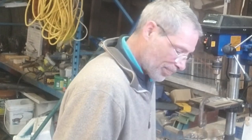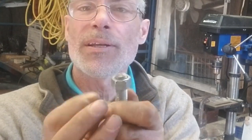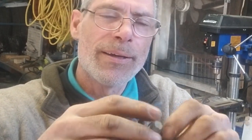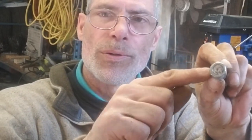I'm going to make the pin with this nut. Now the nut spins freely, and I don't want that — because what's going to happen is the vibrations will keep working and this is just going to come off. So what I'm going to do is drill a hole through it and pin it.